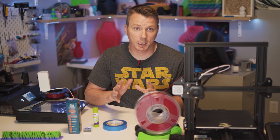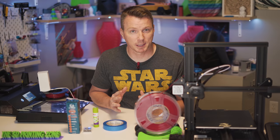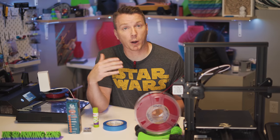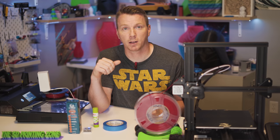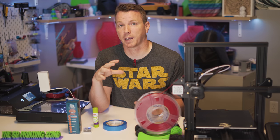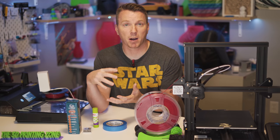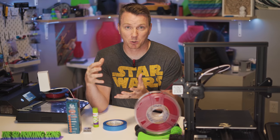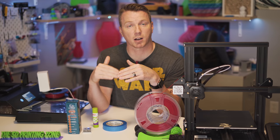If you're experiencing that with a carborundum bed, lift that nozzle off the bed a little bit for your bed leveling or first layer. One thing you should definitely know is that carborundum beds work really well with PLA in particular. If you're trying something that requires higher heat, like PETG or ABS, they may not work as well. PETG tends to have a crazy bond to things — it really sticks maybe too well in some cases, and that may still be the case with PETG on a carborundum bed.